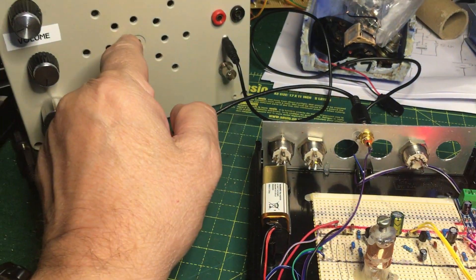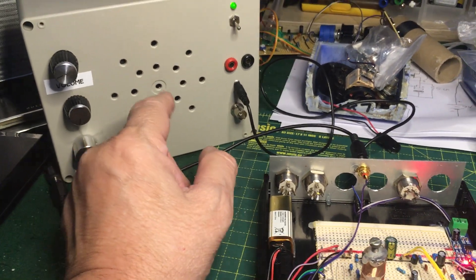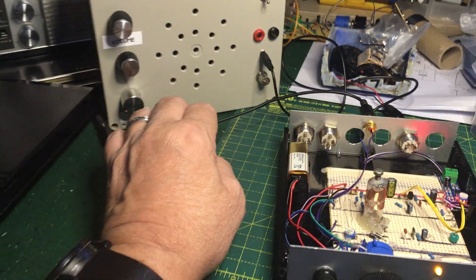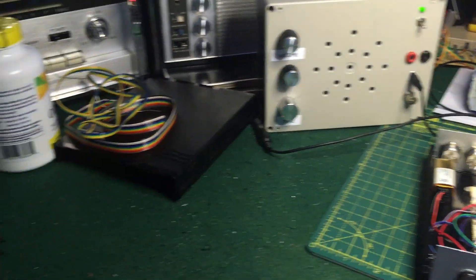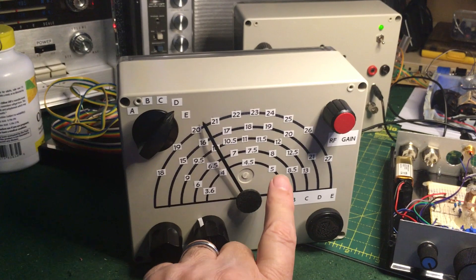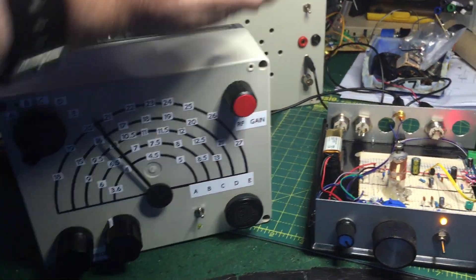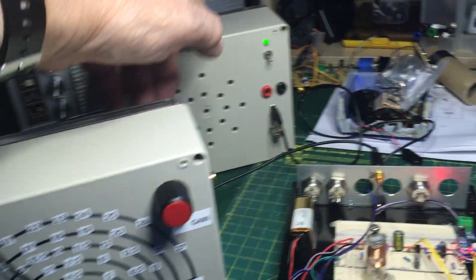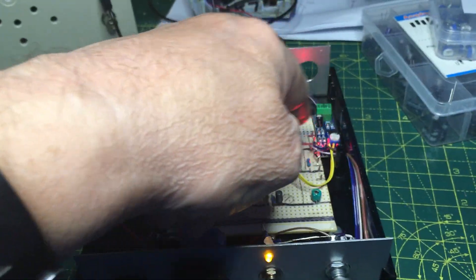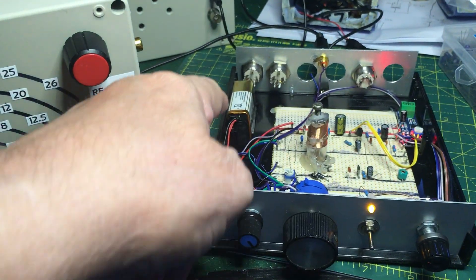As well as the main amplifier, which is about 2 watts or something like that. So it's got plenty of gain, which is handy for signal tracing. I've got another radio here I made - that one hasn't got any preamp in it, so it's very low output. But into that amplifier it works fine, because it's got the gain on the amp. I may put one of these little LM386 preamps into that one as well. They run off the 9-volt battery.